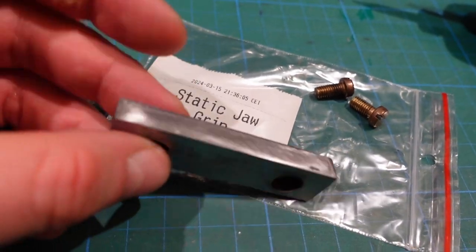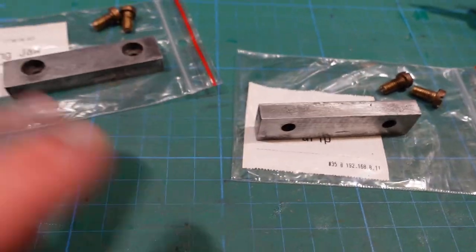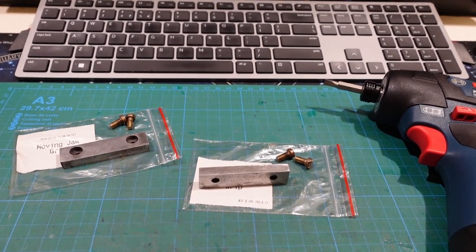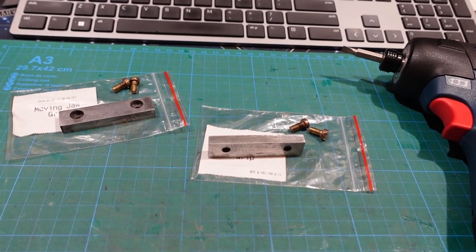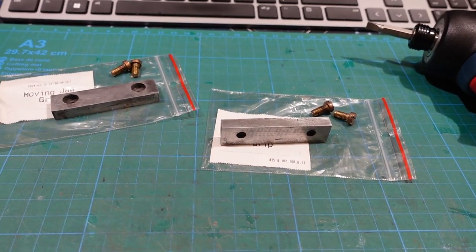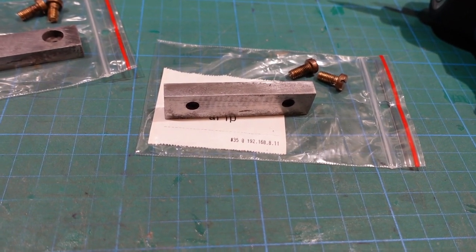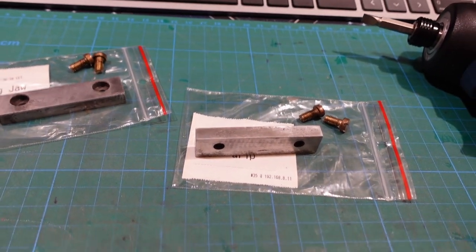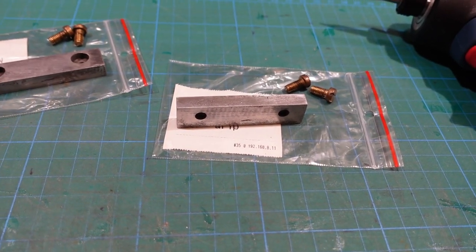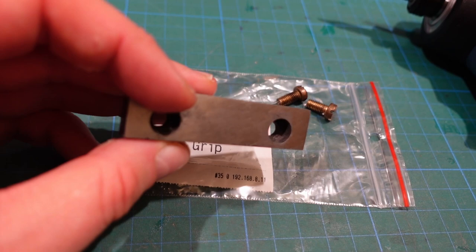But then generous application of hand sanding. What I usually do, I made this board, a cutting board from IKEA, some super cheap base, and then I have places where I adhere with double-sided tape those sanding papers that I buy in rolls. So the first pass is 220 or 240 grit, I think. Yeah, that's the unit, not king's fingernails, sorry, the grit, 220 or 240. In any case, that's really not much of a difference, and that's what really removes the stuff.